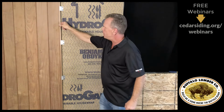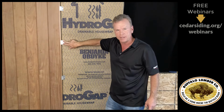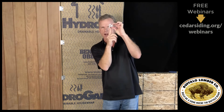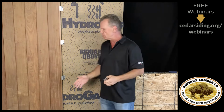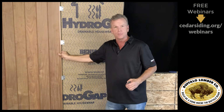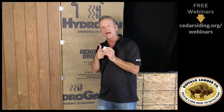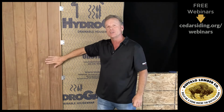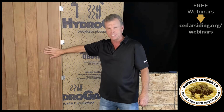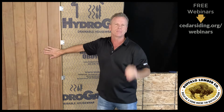Okay, this is ePay. This is a completely hidden system. These clips will screw into a 1/2-inch OSB plywood. The clips themselves create it so that the wood sets off the wall a good 3/4 of an inch. So you've got airspace, you've got hidden installation, and you've got a system that will address every single problem. And when you have the screws that are magnetic and zip right in, it cuts your installation time in half. This is the best installation system I have seen to date. And I had my master builder look at it, 40 years in the biz. He says it's the best system too.